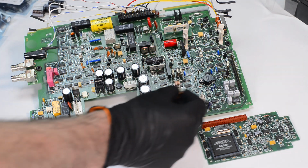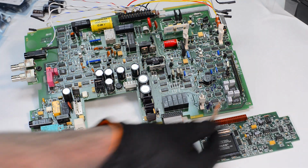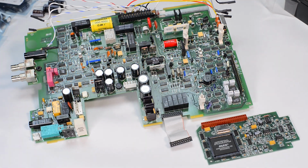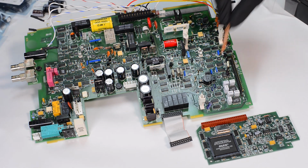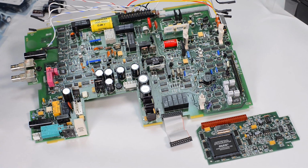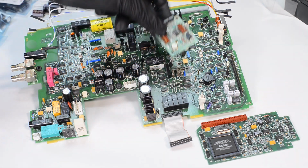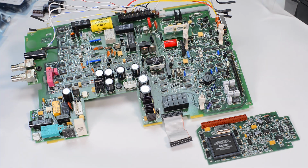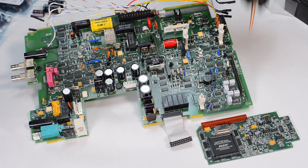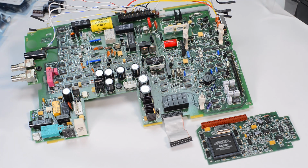Data from the CPU goes to an Altera CPLD on the ADC module, normally placed on a header here. Right under the ADC module is the primary DC voltage reference of the instrument, which is a good old friend, Linear LTZ1000A. Unlike the 3458A A9 board, this reference is not mistreated and not cooking at 95 degrees. LT1043 flying capacitor blocks also generate a few other reference voltages from this 7V primary reference.